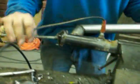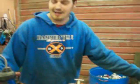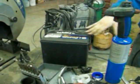Ignition is a regular spark plug off a 350 Chevy, going into a buzz coil off a Ford Model T, which is hooked to a flasher to keep the points on the buzz coil cool. Click that on real quick. Yeah, we can hook it up. If we didn't have the flasher in there, the points would be red hot. And that's just the battery out of my vehicle. 12-volt battery, nothing special.